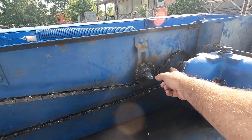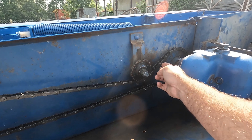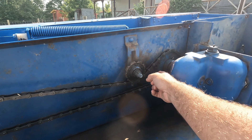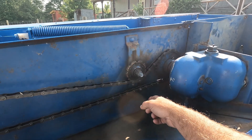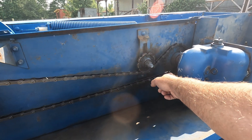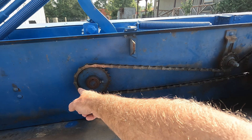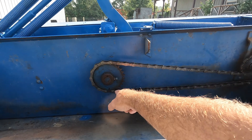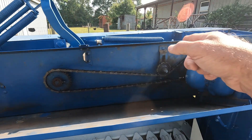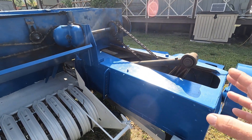The hole is basically in between these notches, and two fingers fit inside between a link. It's 29 links from the hole being in the center of a link around to here — a total of 29 links — and then that hole will be in the center of the next section. That's how you time that fork to that fork.